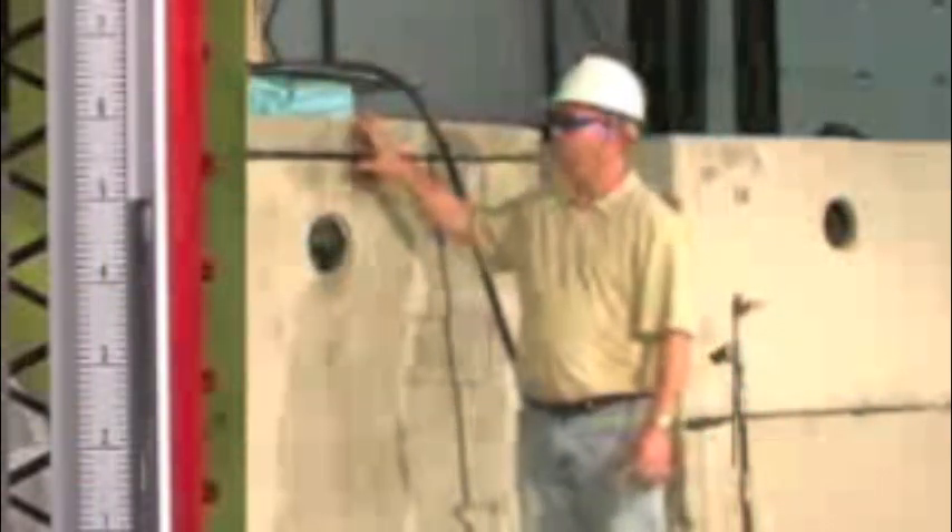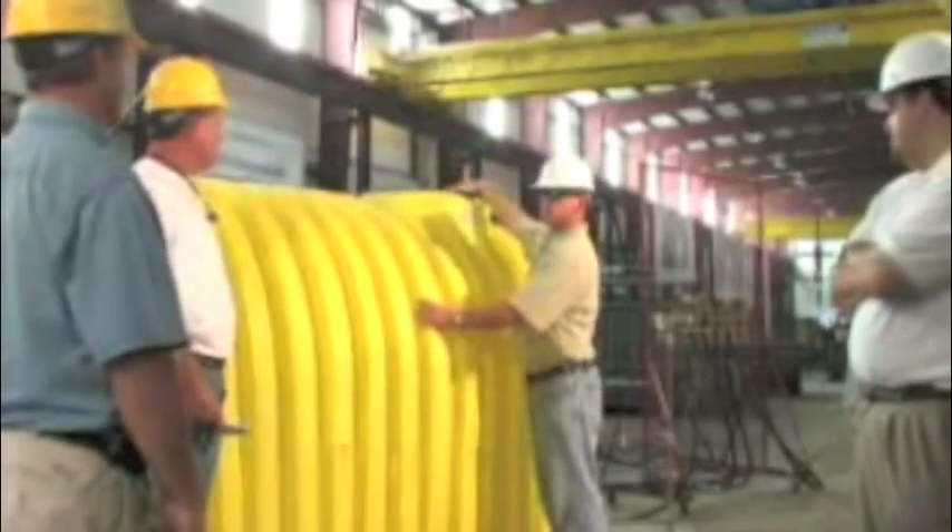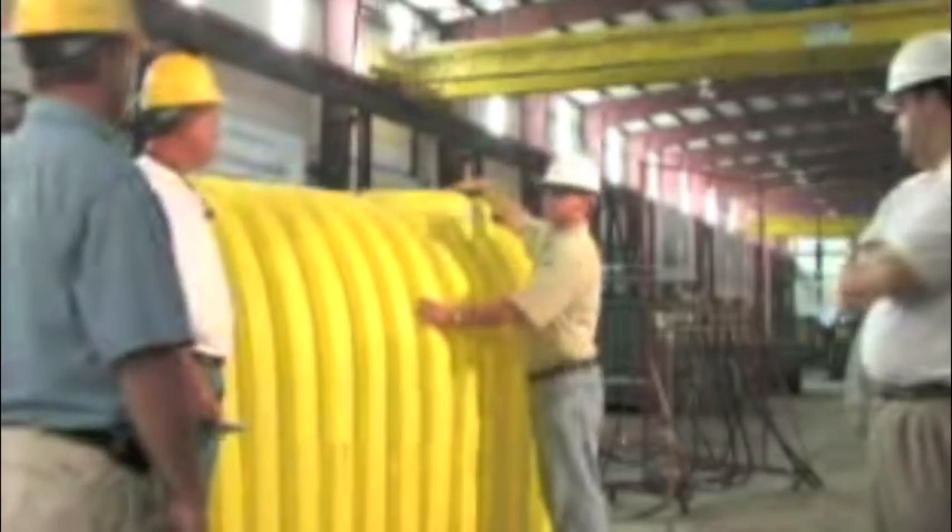We're at five inches of mercury. This is a good test for a tank — it gives a good replication of the loads that are going to be applied in the field: live loads, side loads. It's not leaking, and we're not seeing any indication of creep in the long term. One reason we used steel plates is that in preliminary tests, we weren't able to get any of the risers and lids provided by the manufacturer to initially start the vacuum process. So we removed the lids and outfitted each one with a steel plate attached to the tank with a nipple to the hose, just to initiate the test so we could test the structure.